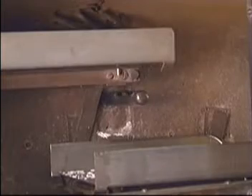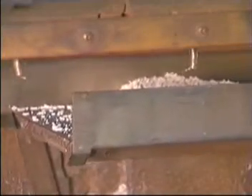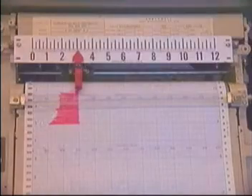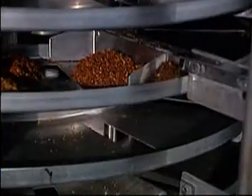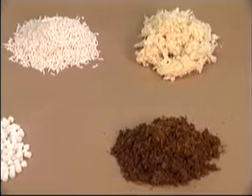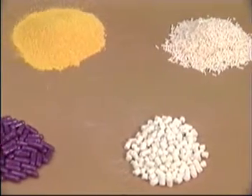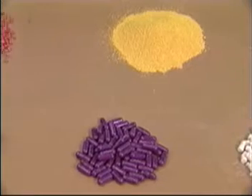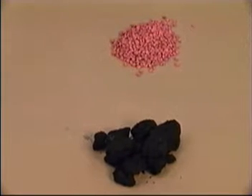Samples may be withdrawn at any stage of the drying without interrupting the test. During drying tests, the temperatures of the air and of the product are simultaneously recorded. The ability to handle a particular material determines the suitability of the dryer. The turbo dryer can be used for a remarkably wide range of products, from pastes and slurries to extremely fine powder. Pre-formed pellets are handled gently, so that they dry with a minimum of breakage or fines. The same is true of fragile crystals. Some form of preparation may be required to feed the material to the dryer in order to obtain a more desirable product.